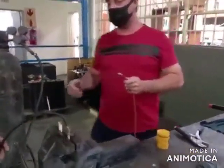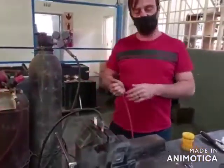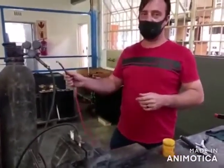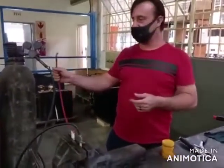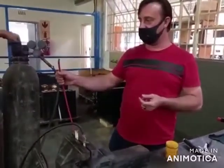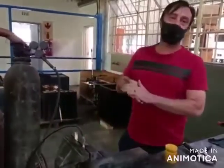So that shows you that the connection of lead onto a cable and your pins is a much better connection. So with the power, there's no arcing. You just put a bit of isolation tape around your lug and your cable where it starts and ends. You'll clean that lug, and that is basically what you can say.